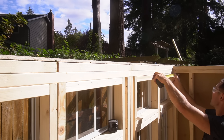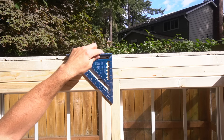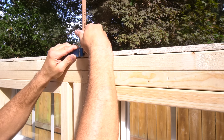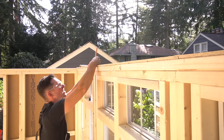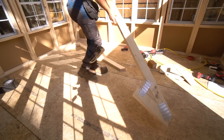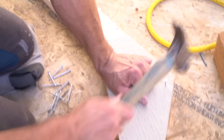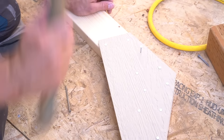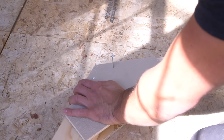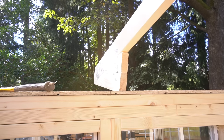Now comes time for our roof rafters. The first thing to do before we install them is to space them out accordingly — each one has to be spaced out 24 inches. The best way to correlate that measurement to the top vertical surface is to take my speed square and transfer that measurement up to the very top. Once all the roof rafter locations are marked, it's time to install the rafters. They're already pre-cut and pre-assembled except for the middle bracket that connects both pieces together. Prior to nailing this bracket to the frame structure, you want to guarantee that you have the right angle needed. Each roof rafter structure gets 2 plates — one on both sides — and each side gets 12 nails, which means 24 nails holding each one of these structures together.